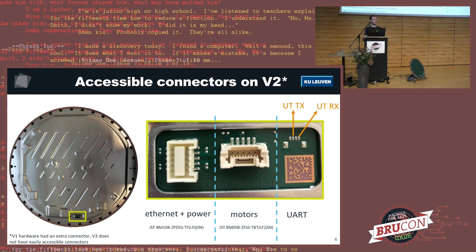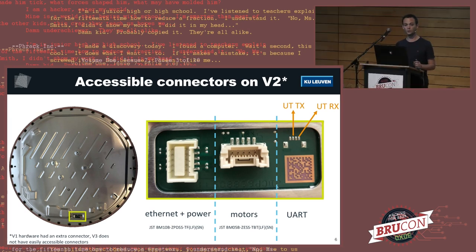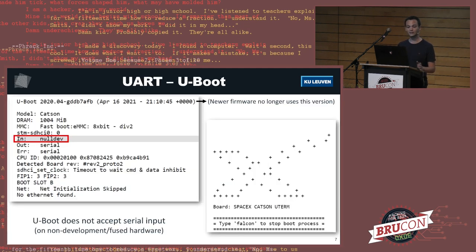We set up the user terminal and started opening it up. If you remove the plastic backing shell, you're greeted with a big metal shield with only a small cut-out containing three connectors: one for power over Ethernet, one for the motors — the dish roughly aligns itself toward satellites then uses the phased array principle to track a satellite flying over — and finally an unpopulated UART connector. If you see a UART connector on hardware, you always get a bit happy, because there might be an easy way into the system.